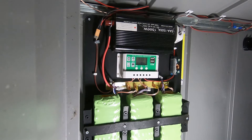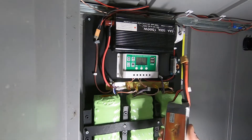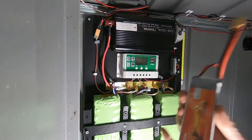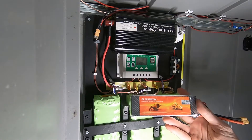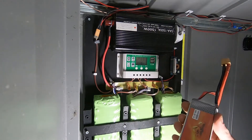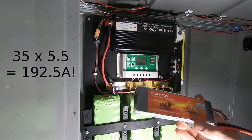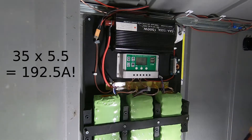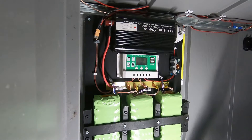With two out of three problems solved, it's time to look at getting some power out of this Powerwall so we can power our pillar drill, which is one of the main reasons for setting all this up. We've added an XT60 connector here because we've gone and got ourselves a LiPo battery. These are designed to give massive currents — normally used for quadcopters or little racing cars. It's rated to 35C, so 35 times its capacity current is what this guy can produce, compared to these packs which probably only give about 4 amps.